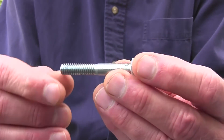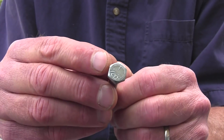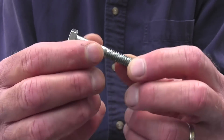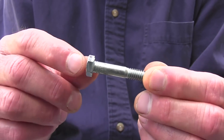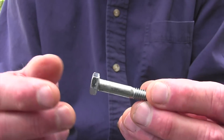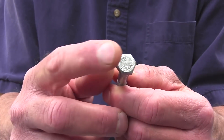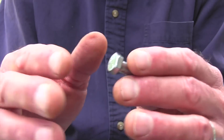The other kind of shear bolt — what's in most rotary cutters — is just a regular bolt, probably a grade 5 with three marks on top. In metric, it'll be an 8.8, or if there's no marking it's a 4.6 or 5.8. One problem is if the manufacturer recommends a lighter grade bolt, you may need to move up a grade if you're shearing them all the time. Alice, if they're recommending a grade 2 or metric 4.6/5.8 and you're shearing constantly, try moving up to a grade 5 or metric 8.8 — a slightly heavier bolt gives a bit less protection but won't need replacing as often.